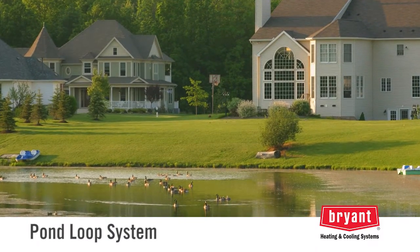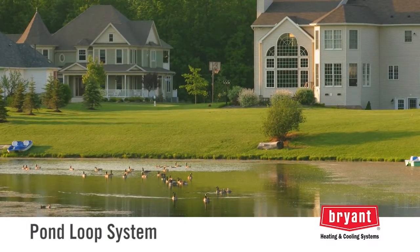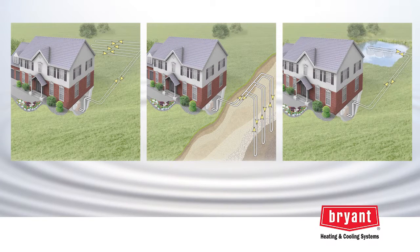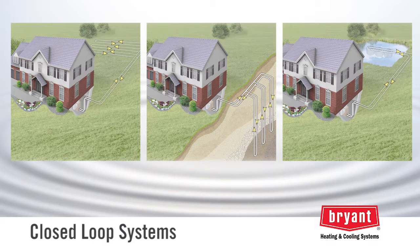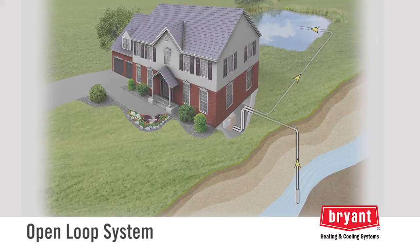Geothermal pond loops can be a very economical solution because the only digging required is a trench from the pond to the house. The horizontal, vertical, and pond loops are known as closed-loop systems because they recirculate the same fluid through the loop. The final type of loop system uses an existing water well instead of pipe in the ground.